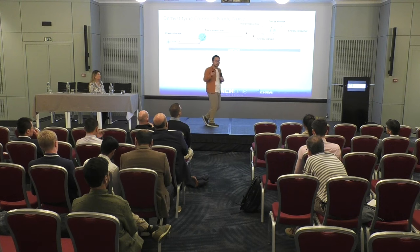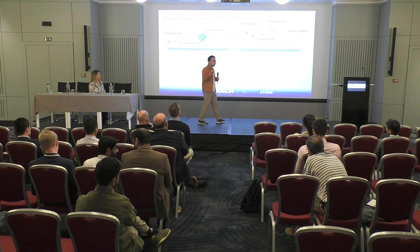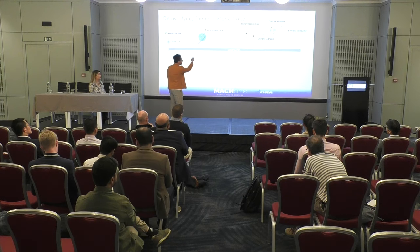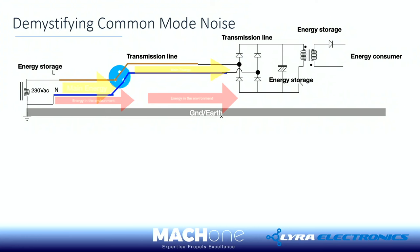Why am I saying that? Because you are using fast switches, right? Those two devices are switching really fast. So we know this energy takes time to be delivered to the final user. What happens next is there will be energy delivered not using the live and neutral wire, but using something like live, neutral, and earth, because energy travels in space. So what we're saying is, if you demand energy at a fast rate, and the main circuit cannot meet that demand, what happens naturally is whatever surrounds the unit will provide the energy.